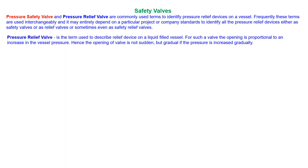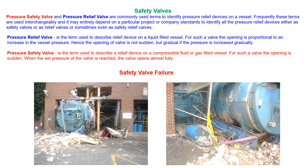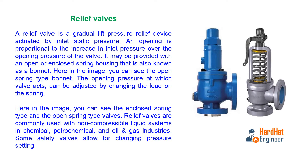Safety and relief valves, properly sized, maintained, and inspected on a regular basis, can prevent major failures. Safety valves are designed to prevent major failure of fired and unfired equipment. Relief valves are designed to control overpressure in equipment. They can be adjustable or fixed in the pressure settings. They are not designed to meet the requirement of a safety valve.